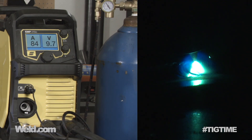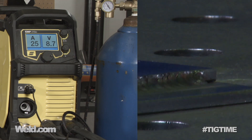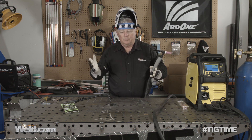Okay, so it's starting pretty good — no complaints. I'm only making about a 2-inch weld here on mild steel. I'm using an ER80S-D2 filler, 0.045 diameter. Getting near the end of my weld, I let the slope control take over — 5 seconds and it tapered out. Actually, it just tapered out beautifully. I didn't have to swirl or anything else. It tapered down, there's no crater crack. So you can do some general fabrication with this without a foot control — it just wasn't a problem at all.